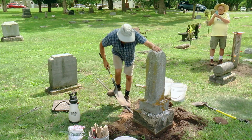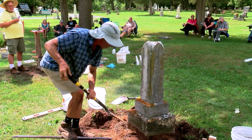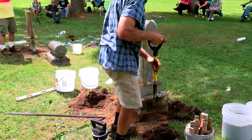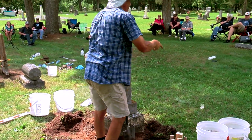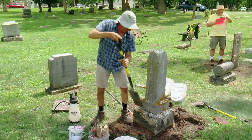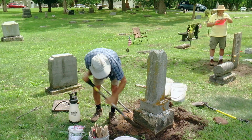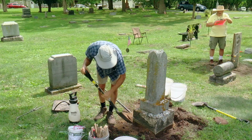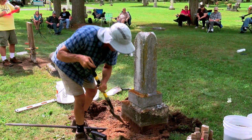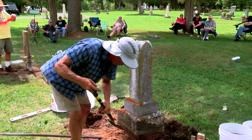So I'm going to go a little higher now. Low angle. So what most people do when they do this is they're standing more in an upright position, and they pack a little bit like this, and it makes a perimeter, it makes a ring, it'll stay there. We really want to go low angle, corner of the shovel. So instead of up like this, down like this, angle, go under. And the thing about this kind of work, it's a lot like work. And we don't want to be shy about this. So we're trying to fill the whole void in, compact it so we feel pressure against us. So there's no voids if possible.